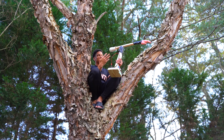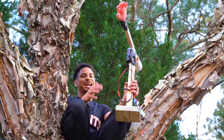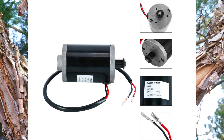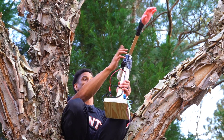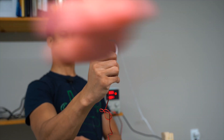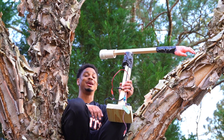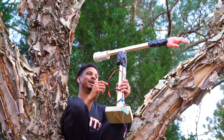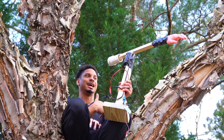We'll begin with the physical portion, but we'll try to be quick since you've already seen the movie. So right here we're using a DC motor — a 24 volt, 150 watt motor. I need a big motor like this because this arm is pretty heavy. I tried using a DC motor with 30,000 RPM, but quick tip: RPM does not equal torque. It may be really fast but really weak. This isn't as crazy fast, but it's definitely strong enough to spin anything I put on it.